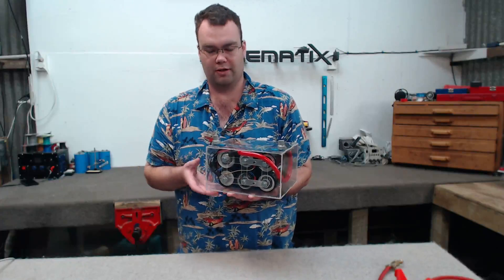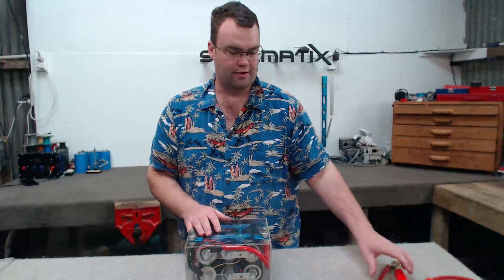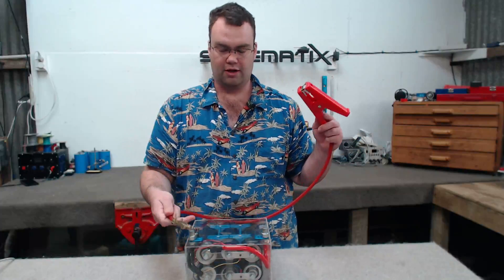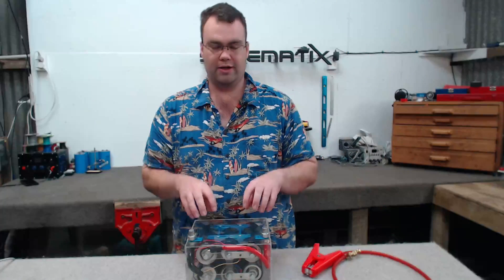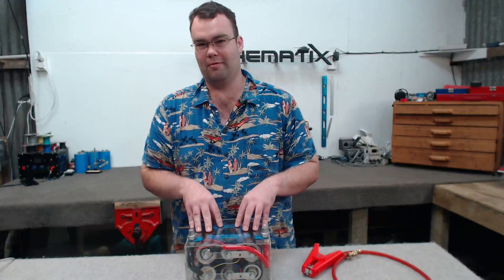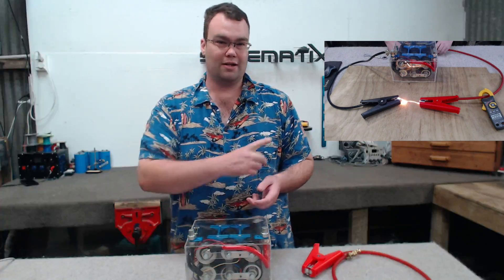I've finished charging and testing the super capacitor bank and everything checked out good, so I've gone ahead and glued on the bottom panel — it's now absolutely finished. Off camera I also made a set of jumper cables from 2-gauge copper wire that can clamp onto the battery lugs, because perhaps the most handy use will be as a jump starter for vehicles with flat batteries or a tractor in winter. If you want to check out how well — or not well — the super cap bank performs, things like burning wire, dead shorting it, hooking up to a car, then click the video link in the top corner. Thanks for watching — I'll see you in the next video.